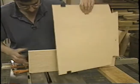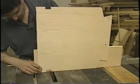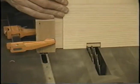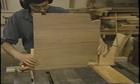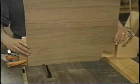My pattern helps me to set up the stops for the front notches, which are easily cut on the table saw because they're square. I clamp these to the high backer board that's screwed to my miter guide. Out goes the pattern, in goes the seat plank. A dado blade helps get the wood out of there quickly, and it leaves an acceptably smooth surface on the bottom of the notch. If you use a regular blade, you'll need to chisel out any roughness on the bottom. That's an important glue surface.